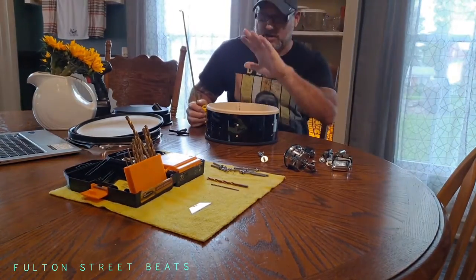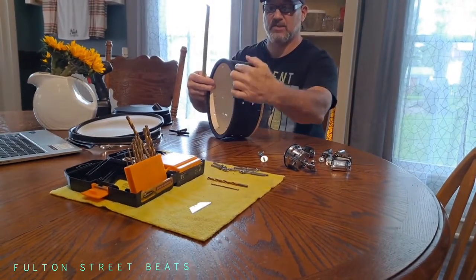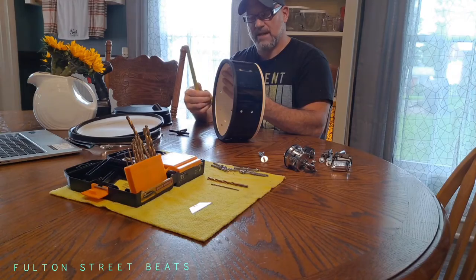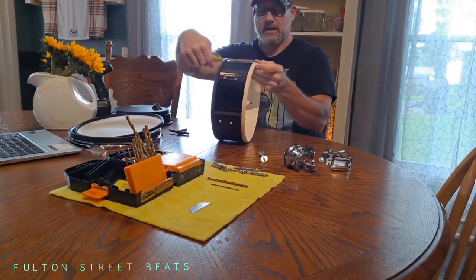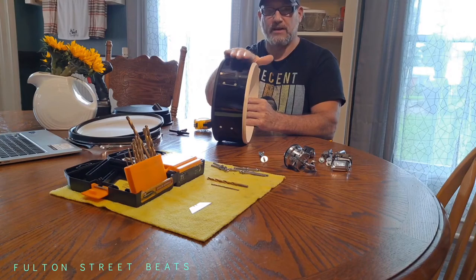And you're going to want to cut a piece of vinyl that's going to come up to, well, where this is pre-cut here. We want to use the straightest edge on the bottom because that's what's going to be seen butting up against this rubber on the bottom, this rubber gasket. And the measurement here is 3 1/4. So from here to the bottom is 3 1/4. So we're going to cut a strip that's 32 inches long and that is 3 1/4.